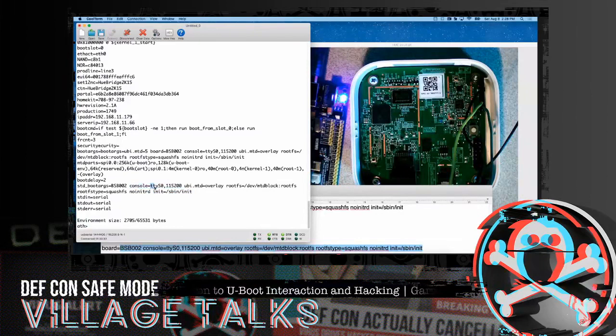If it's not set, often when you identify the processor that may be used, in this case, you can do a little Google reference and identify the most common TTY setting for that. A lot of times it's in the data sheet, to identify how it is naming its primary console TTY. So often data sheets, a little Google on the device or the processor, will be able to identify that. And that helps you to literally set the console where it actually needs to be.